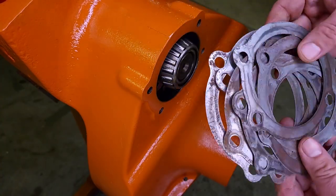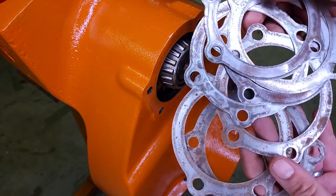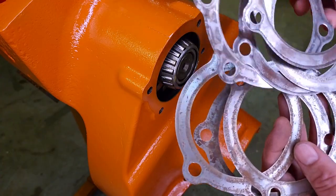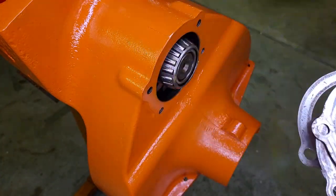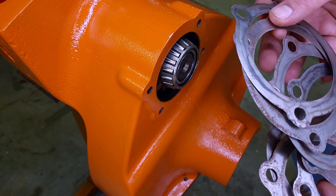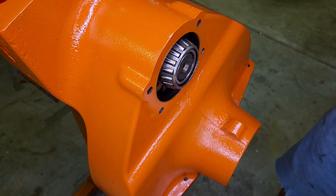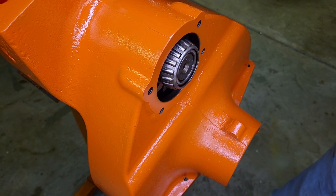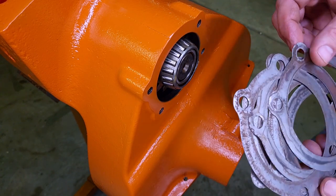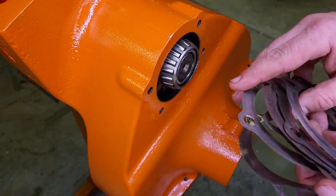So I have a bunch of shims here. Unfortunately, I never counted to see how many came off each side when I took it apart, or if I did, I don't remember. I don't know if this is one or two or all four final drives worth, but I got a ton of shims. We're going to start large - probably four or five of these. We'll tighten this cap down and see if we have any end play. If we do, I'll take it apart, remove a shim, tighten it back down and go from there. I'm not going to put any sealant on these yet - I'll wait until I'm totally done in case I have to take it back apart.